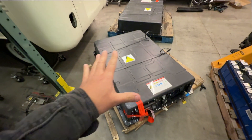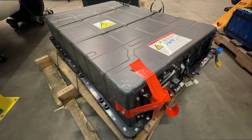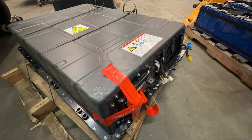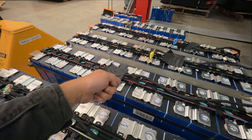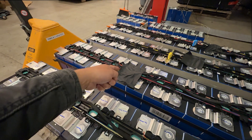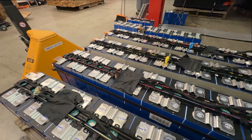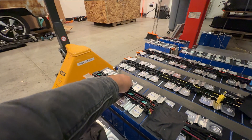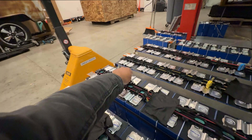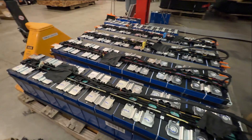If you're thinking about buying one or already have one, this is the easiest way to do it. Just open it up — there's a soft cover here. Take all the screws off, take the main cables off, and then you just have to make two cuts. One cut here at eight cells, and then eight cells over, cut that one right there. That's it — two cuts. Then you tap right here and put a little bus bar or ring terminal so you have your terminal for each side module.